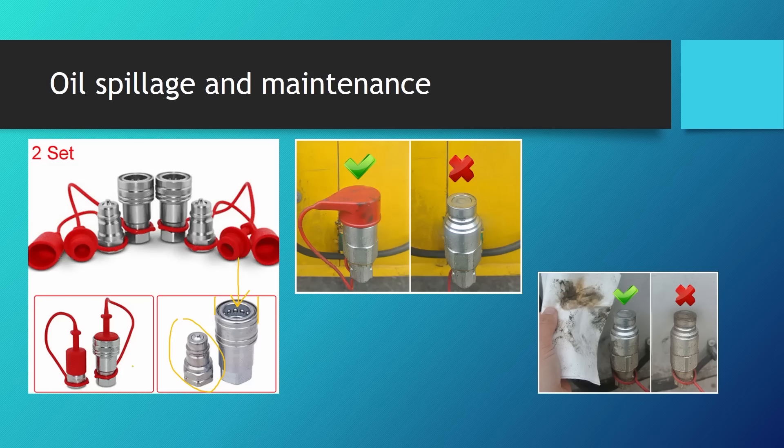If handled correctly and properly maintained and cleaned, these couplers have proven to be very reliable components used vitally in hydraulic systems. If you don't have the little plastic protector on your coupler, you should go get one — it's very cheap and ensures your couplers last longer and stay free of dirt when the auxiliary hydraulic system isn't in use. Remember: oil accumulates dirt and grime, so you have to clean them and keep them covered and protected.